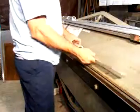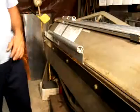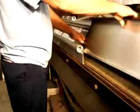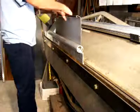In this step, we're going to remove the L shim from the T slot to do our Z-shaped bend on our next part. Got our piece pre-bent. We slide this in the T slot from the end. And once we get it in place, pull it around till you get the degree that you want.